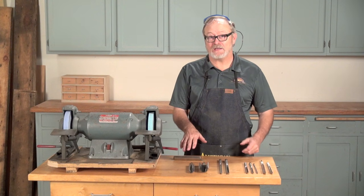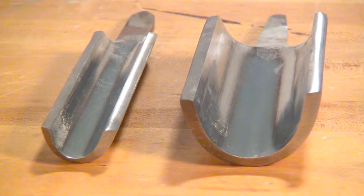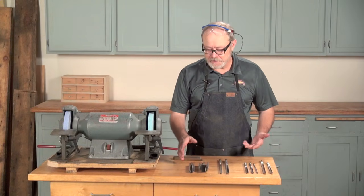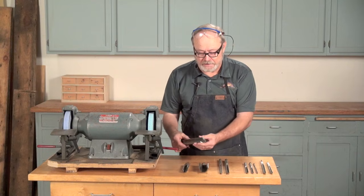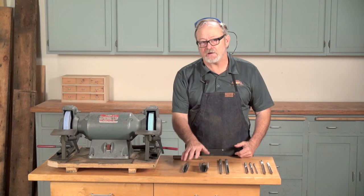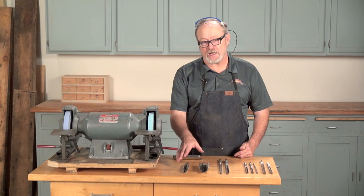What I have here on the bench in front of me are the three main types of woodturning gouges. Right here we have what is known as the spindle roughing gouge, and I have it in two different sizes. It's not used for bowl work, and there's a problem if you do — this tang in the back can be very weak, and you can snap or bend it off in bowl turning. It got its name 'roughing gouge' because it was used to take off the corners on a square mounted between centers generally. It also does cylinders and tapers.